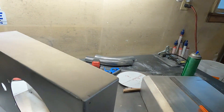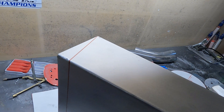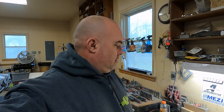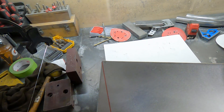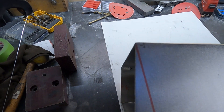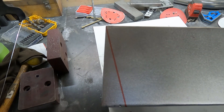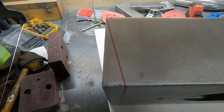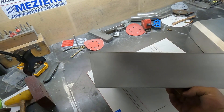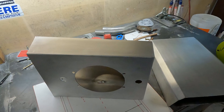As you can see I've gotten the back filler panel on and welded, everything is sanded and blended. The only thing I want to do now for a little bit of looks so it doesn't look so boxy is put a little bit of rake to the front end — cut the front end on an angle, take an inch off the bottom and leave the top alone. That way it sits on the car with a rake to it and looks faster, sportier, more hot rod.